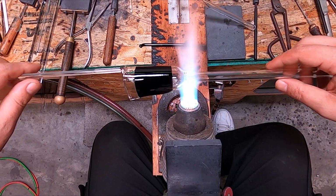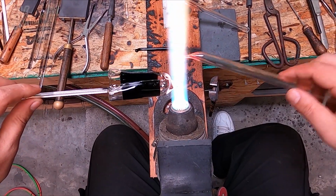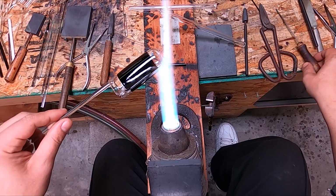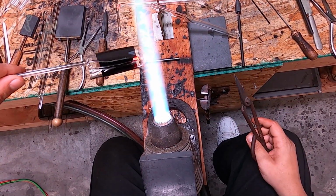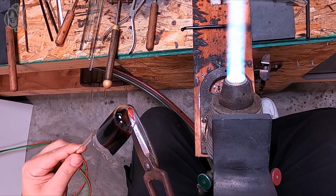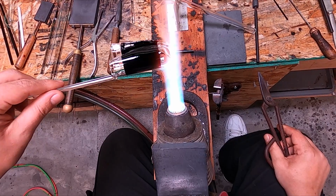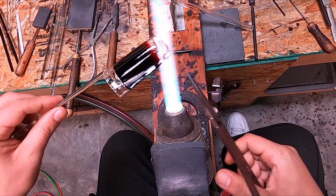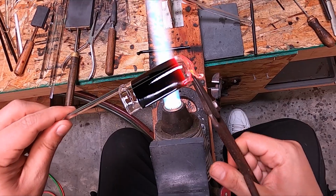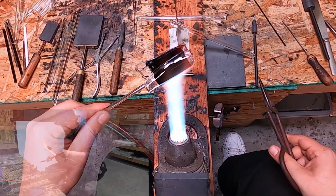At this point, what we're trying to do is to take this tube and completely open it up into a piece of sheet glass. So to make the other end so that it will open up appropriately, we need to continue that cut. First, by continuing the straight cut up the side. And then getting all the way around hot so that we can cut the end open like a cylinder. Like I said, no part of this at this point needs to be pretty. We just don't want to mangle our black.